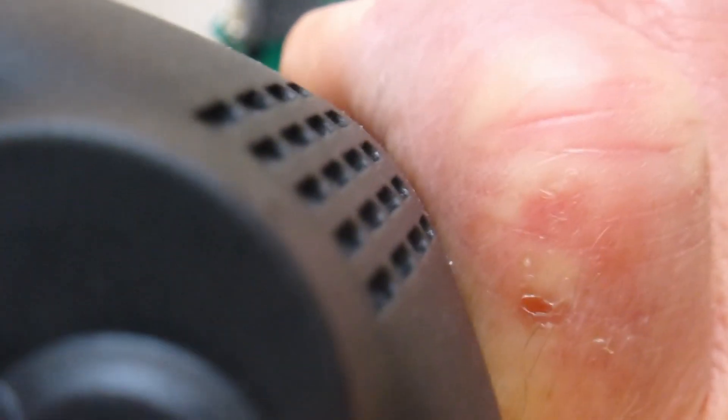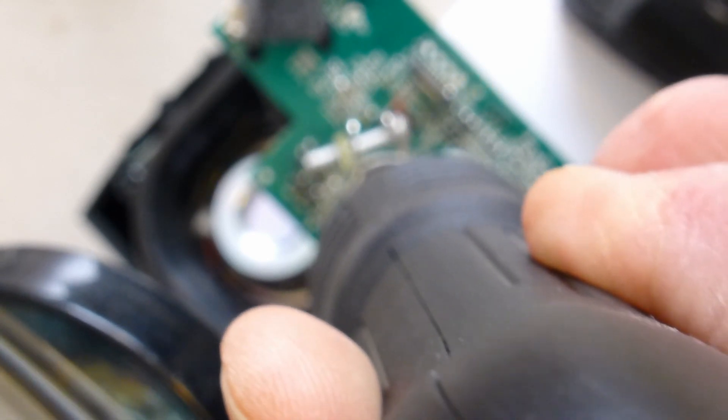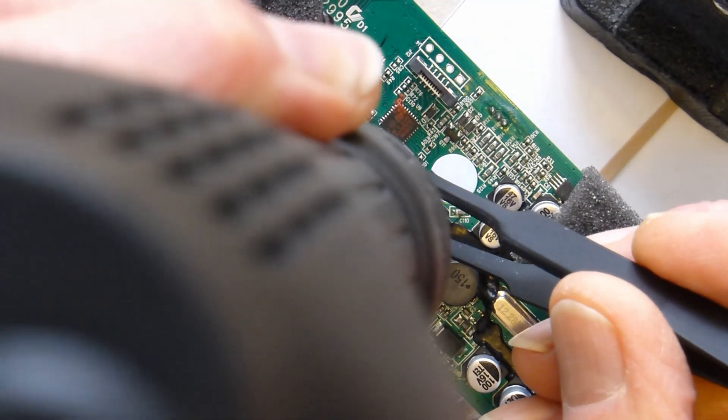I think I can see the solder on the left-hand side is now sort of wicking up onto the chip. I need to go around with an iron to just tidy that up a bit. This other side looks alright. I knocked it over a bit intentionally, but it's not quite in the position I'd like it, so I'm going to have to ease it up a bit more just to help get it in position.